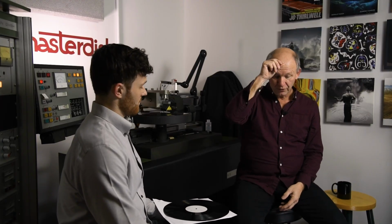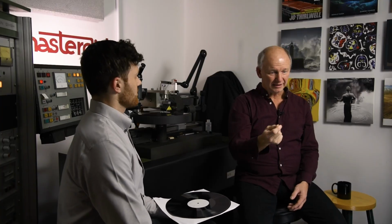So we listen back to test pressings in a very, very specific way. We know what the audio sounds like. We've quality control checked that up to this point. What we're really looking to find out is, were there any major flaws added to the project during the plating? So to do that, we take each side of this project and we play 2 test pressings. One all the way through, noting where the ticks are, and then another one all the way through, and we line those up very carefully. And if there was a tick on one and it wasn't on the other one, then we know that our stamper is okay.